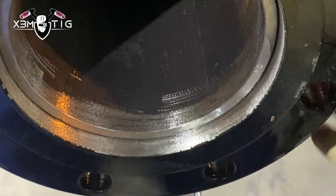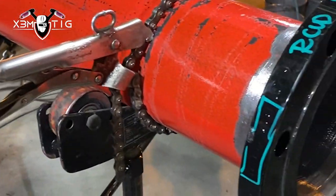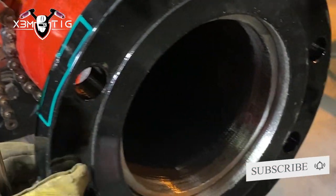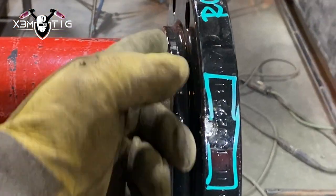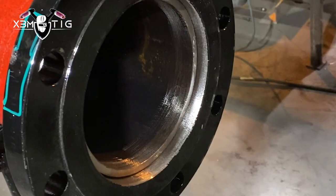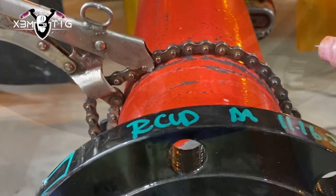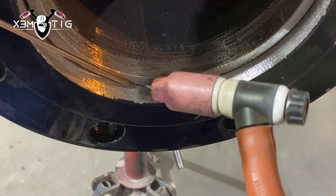It's possible to do just a single bead as long as it's a nice profile weld. I've got a setup here in a pipe stand — I'm just going to roll it with one hand and do sections. A little tip: when you tack, do small tacks. When you tack from the outside you don't have to tack inside, but it's a good habit to start welding first from the inside, because it's not going to move and it'll stay square. If you do from the outside it might go out of square.